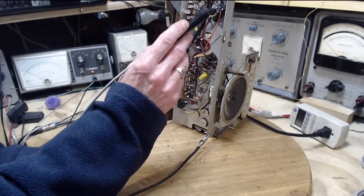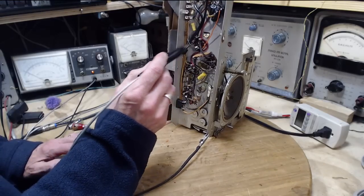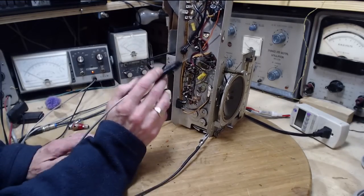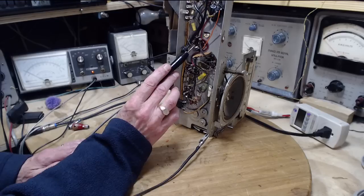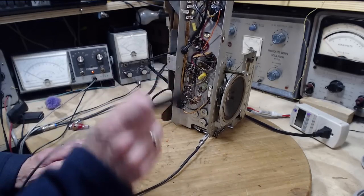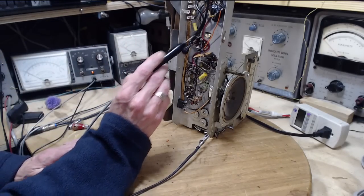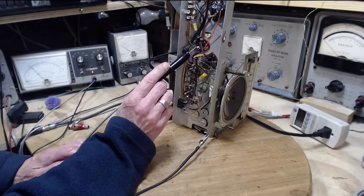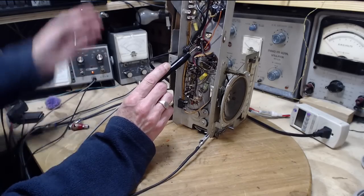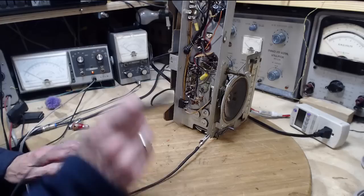And then this is the 80, isn't it? No. Should be positive. About 6 volts, I think it said. Let's check. 15 volt scale. It's 3 volts. Let's just make sure we're getting the radio full voltage, 123 line volts coming in. It's still a little low. It looks like two of them seem low.